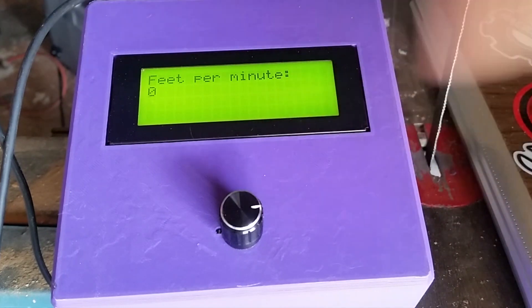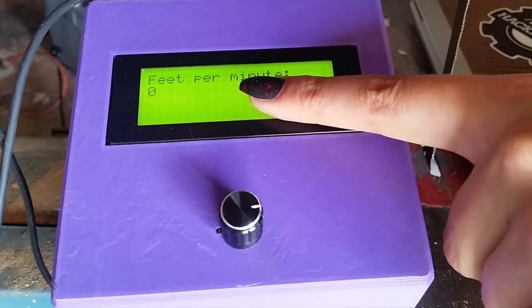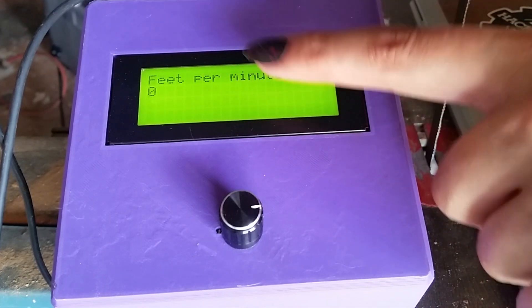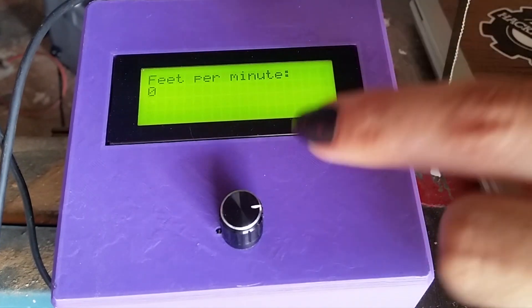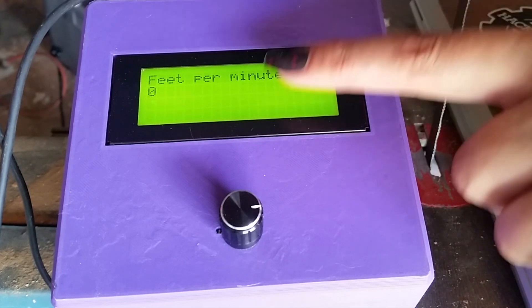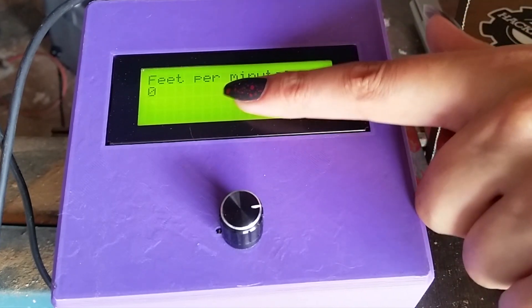The figures are close. It was actually off by 15%, and I thought maybe the Arduino wasn't working right. But it turns out it was a software issue — I had entered the wheel diameter as 16 inches instead of 14 inches. This is a 14-inch bandsaw with 14-inch wheels, so that math error accounted for the difference exactly.